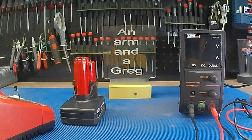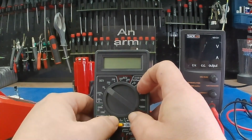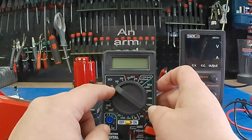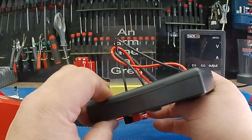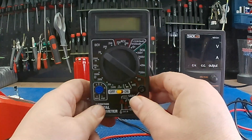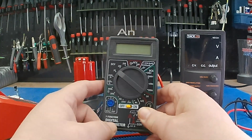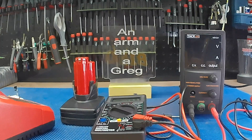Yeah, I definitely think it's a good alternative. If you're out in the field and all you have is another 6 amp hour or M12 battery, you can hook them up and charge each individual cell — we did that before and it worked. Or if you're lazy and impatient like me, just grab a 12 volt power supply and charge it up. As far as the multimeter goes, it's right on the money for DC voltage and resistance — good for coursework, it'll get you in the ballpark. Transistor checker works-ish. Most people are just going to measure voltage and resistance. I wouldn't use it for AC voltage — doesn't seem very reliable. But I think it's a great option if you're just getting started in electronics, tinkering around the house, or you just want to see if a wire is hot. Good for putting in the boat. I hope this was helpful — thanks for your support and thanks for watching.